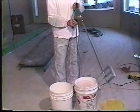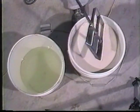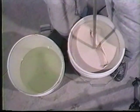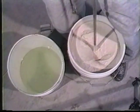A 1/2-inch reversible drill is desired, though not necessary for this operation, as the Super Speed Mixer is more aggressive due to the extra twist on the bars that tends to splash the mud over the side of the bucket if care is not taken. The reverse action, when starting to mix the mud, prevents this.